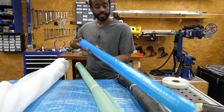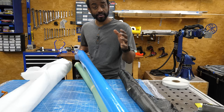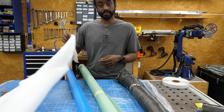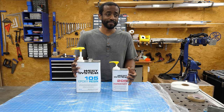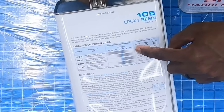The next layer is a peel ply layer. If you use one type, you'll get a much shinier finish — it holds the resin next to the part so you end up with a glossy hard finish. If you use the more fabric-like layer, the resin seeps through and gets soaked up by absorbent material on the outside. Either way, you put the absorbent material on top and then put all of that inside your bag. This is the epoxy resin we're using — at room temperature, 73 degrees, I can look at the guide to confirm set times at that temperature.